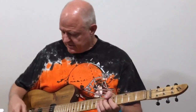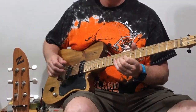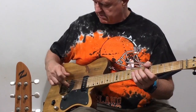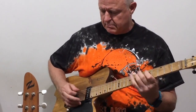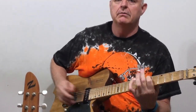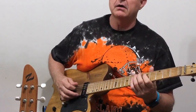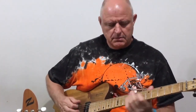Fascinating one, I mean, other than, I usually love playing neck pickup, but got that. Then that's both pickups, just your regular in parallel. Sparky, pretty. Yeah. And then that's bridge. That's your traditional Tele tone. Yeah. But the next one I like is kind of a throaty. Okay, that one is both pickups in series. So you're getting a humbucker there. That's humbucker power. Okay. It's kind of full. It's thick, yeah. Ballsy. Yeah, it's basically a humbucker.